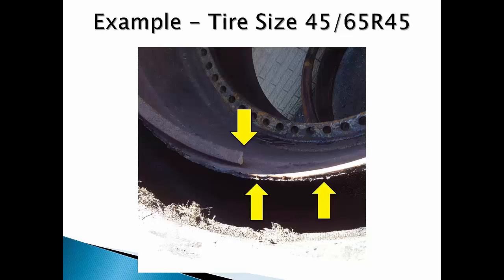What is more revealing is that the mill had been neglecting wheel maintenance and inspection, which would have caught this defect before it resulted in a failure. They weren't checking their wheels, weren't tracking them, and had no idea how old their wheels and parts were. The wheels were pretty much invisible to them — standard operating procedure was just to put a tire on them, air them up, and run them. Was this incident preventable? It absolutely was. Had they been doing a wheel inspection and repair program, this type of defect would have been caught during a thorough wheel inspection. Of the five conditions, this one is clearly: the wheels and components were not in good serviceable condition. The mill has now begun a wheel inspection and repair program to catch these problems before they become potential large accidents.